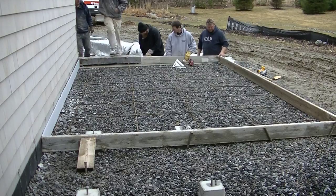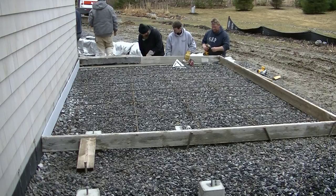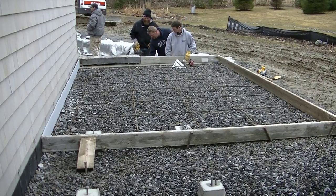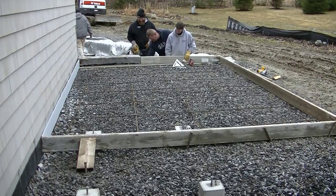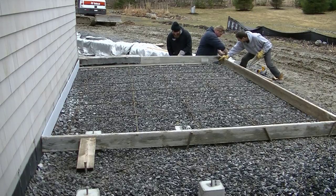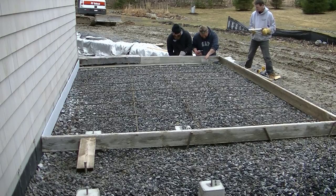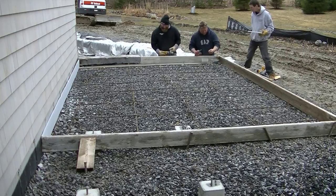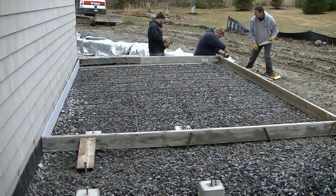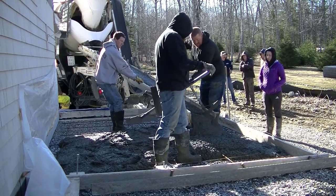We had to wait for the landscaping guy to get that granite step in there before we could put that last form on. We're going to match right up to that granite step. And you can see the form we're putting on now — we're screwing it right into the concrete foundation. So we're using that DeWalt hammer drill with a masonry bit. My guys love that battery operated drill. That will be down in the description — it's one of their favorite tools for drilling and screwing boards into concrete. And that form, you can see with Luke screwing it in the end, slopes a little bit away from the building.